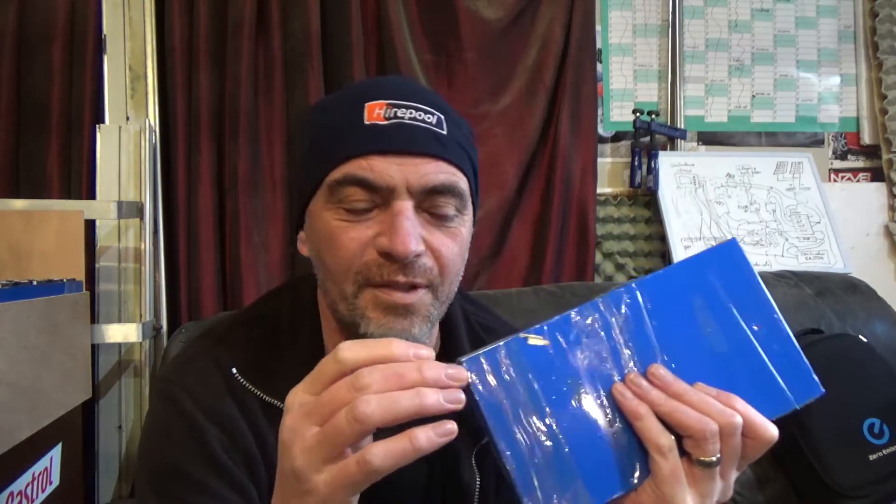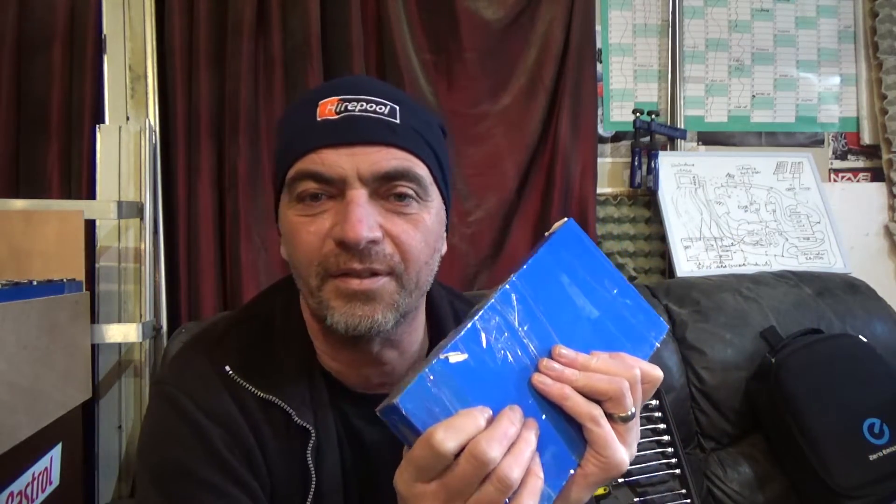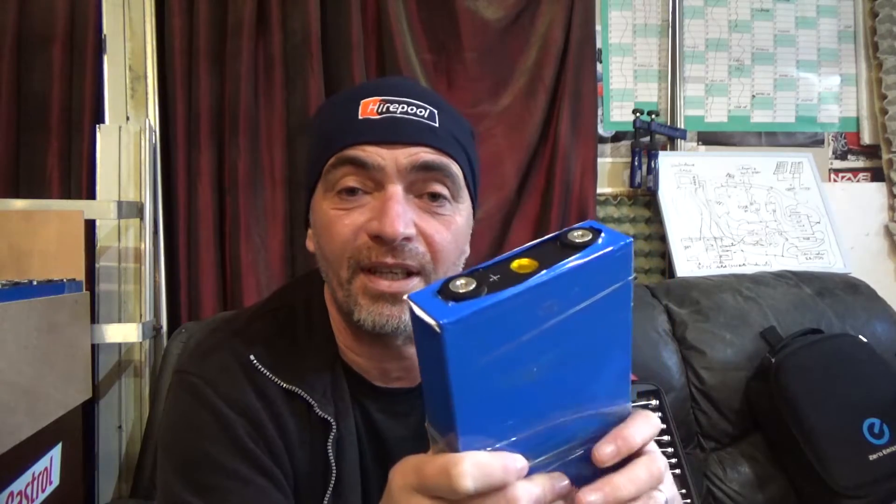Mid balancing was more effective but unfortunately I never got to check that second round. What's probably more important than the initial top balancing is the various capacities of each cell — I won't really have a feel for that until I put it through a cycle or two. So I'm simply going to assemble it in any order and crank it up. The Electrodacus won't let me over-discharge any cell, won't let me overcharge any cell or group of cells, and once they're grouped in parallel they are effectively just one big cell.